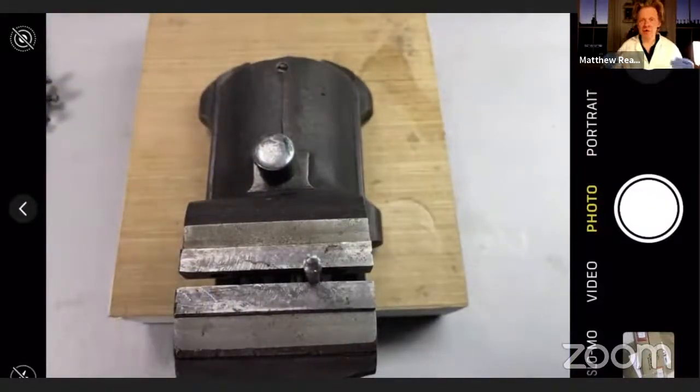Yeah, if you're doing this under non-demonstration conditions, then use Rocol. You can buy either a liquid cutting fluid, which I think is by Ambersil or somebody, and I've not found that so good. I found the best stuff, but it makes everything completely yucky, so you've got to clean everything afterwards, is the usual Rocol with a little hole in the top of the can and a small paintbrush in there. Or if you're cutting a lot, like turning, I just trail a bit of paraffin on the work as it's turning with a small brush. And I find that's enough.